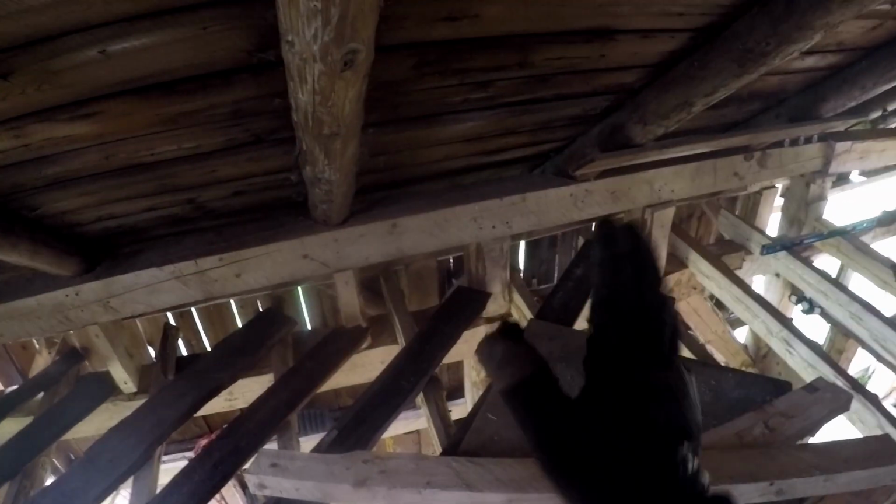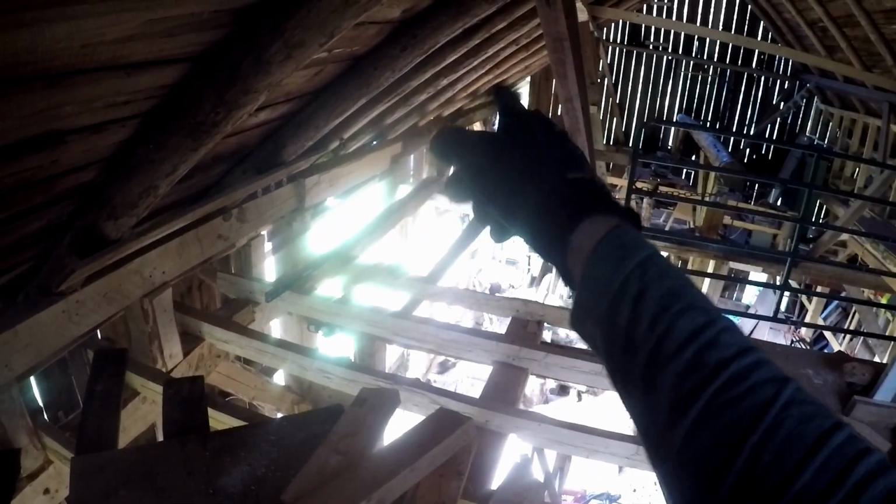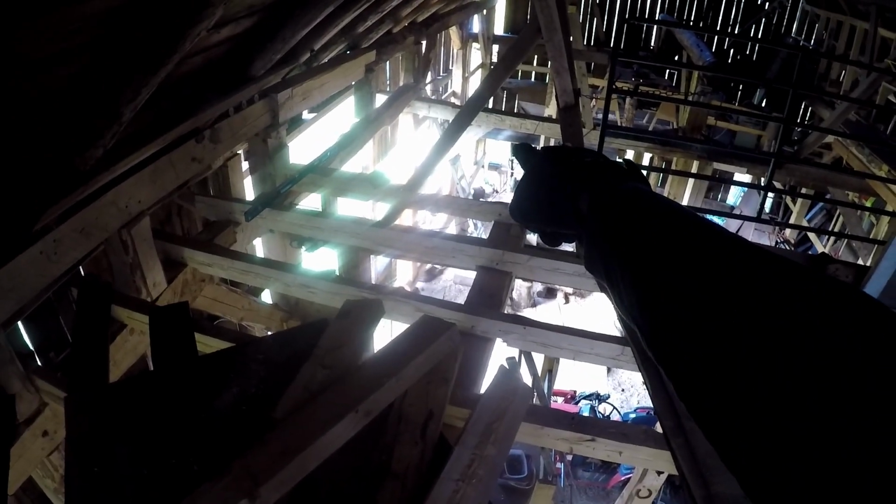the top of the wall there over the door. Not happy with it. It's not in yet actually, but it looks like we have an alignment issue. It looks like this section of wall here is just a hair further out than that section of wall over there. And I think I know what happened. I think the last footing over there got moved, so the whole thing got a little screwy.